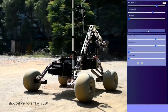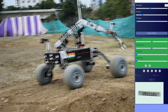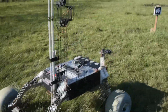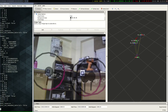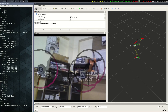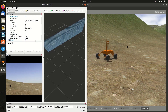The speed, acceleration, and error offset of the rover can be dynamically modified, which aids in certain tasks and provides real-time feedback from the rover to ensure secure remote operations. The development team has introduced focused upgrades in autonomous traversal. The existing navigation algorithm has been refined with the addition of a stereo vision-based obstacle avoidance algorithm. A new algorithm for AR tag detection and rover alignment for autonomous tasks has also been developed. These technologies were extensively tested and executed on Gazebo simulation for optimal performance.